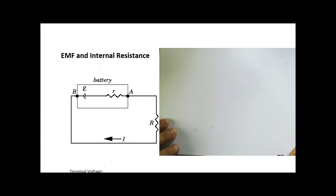So inside a battery, we're going to lose some of that voltage to the wiring and the connections and the way that it's hooked up, and maybe it has its own monitoring system. So conceptually, the chemical part of the battery is putting out more voltage than you receive when you get to the terminals of the battery, right?